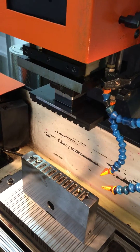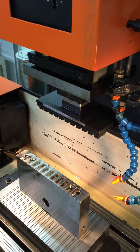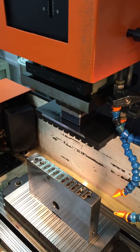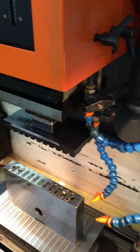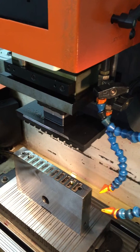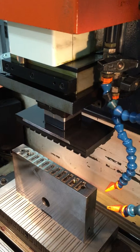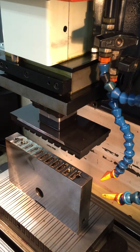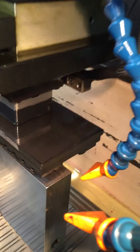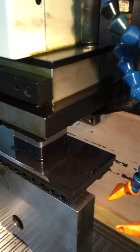Moving it in the X axis, moving it in the Y axis, and moving it in the Z axis. You have to be careful on the Z — if you don't have the touch active, it can break an electrode off. So you want to have the touch active or be careful. We have it down close now.